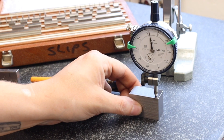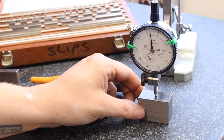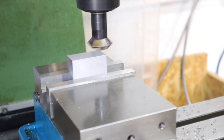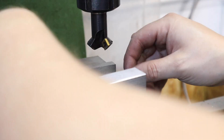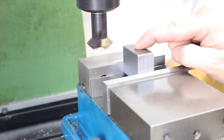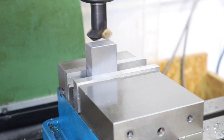One final check and we're looking pretty good - about 0.0405 millimeters out, so that's pretty good. The last thing to do on the block preparation is just chamfer all the edges - everyone loves a chamfer and it's going to make the part look and feel really nice. I'm doing a 0.5 millimeter chamfer, nothing major, using the back fixed jaw as a reference for some speedy chamfering.